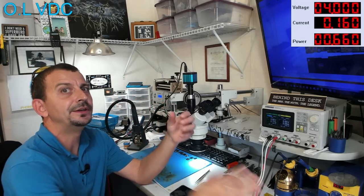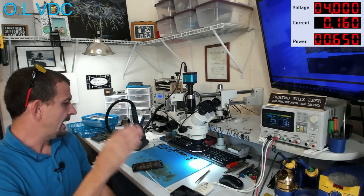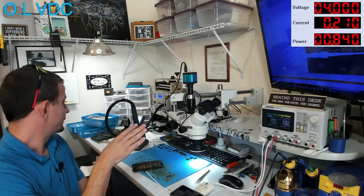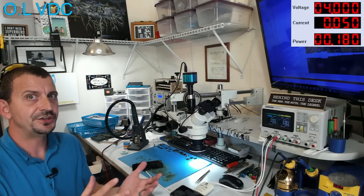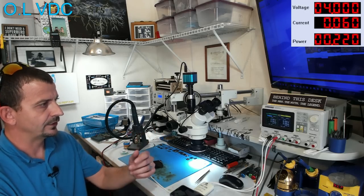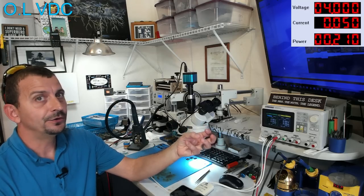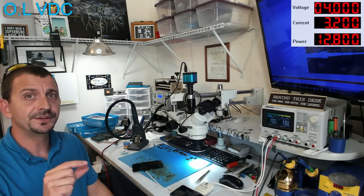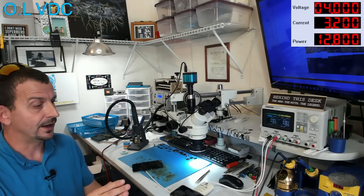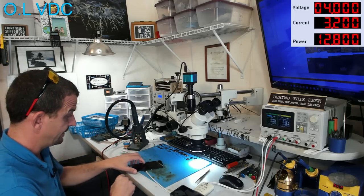This one is a bit unique because we did take the foreign board and swapped all of their components over to the United States board that has all the 5G hardware and whatever else is on that board. And it does actually work. Now, I don't know if it would work without changing that board ID resistor. It most likely would not. It's very important for the board ID to match, but yeah, that's exciting.